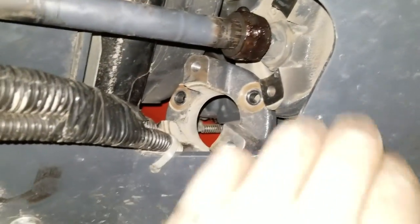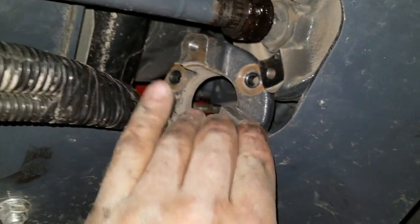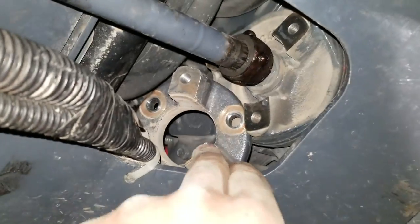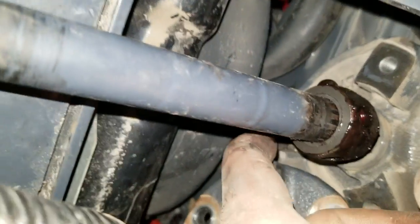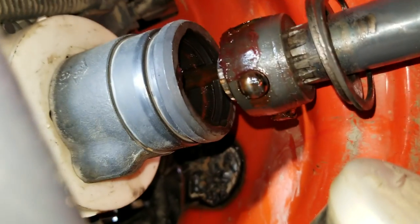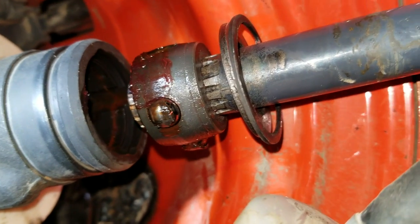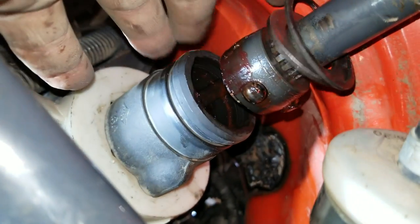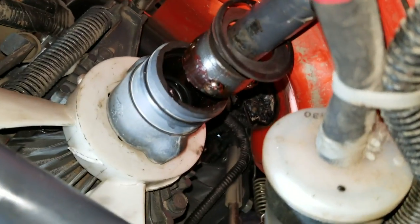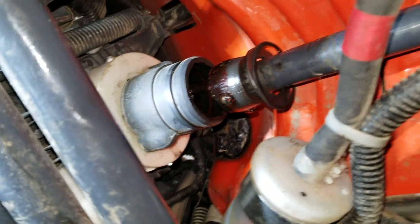Update: I got that front plate off. I put the one that connects right to the engine up in here, and I actually dropped out the other one. A couple of the ball bearings sit in here — there's two still in here and two out. Then again, back here, same setup. You just had to take off that snap ring and that popped out. Now I'm about to remove this whole assembly, and then that will get me at the fan.